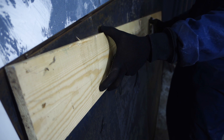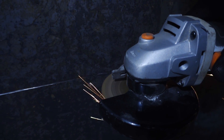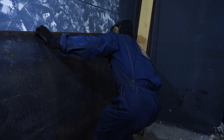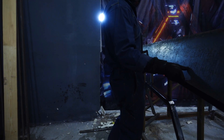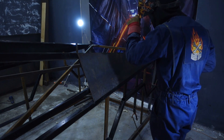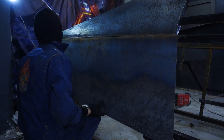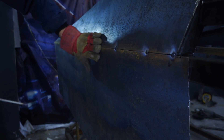Now I start sheathing the back. I don't have a long ruler, but I have a strictly flat board nearby which I decided to use. I'll cut everything out on weight, which is also convenient — I don't need to reach out as on a table. During this video, I used 32 cutoff wheels to saw the body elements. I cut two parts at once for both sides of the body. After welding two elements, I realized it'd be better to weld a large piece and cut all the lines along the existing frame — that will be much easier and all the details will definitely fit in their place.